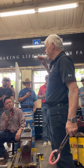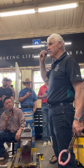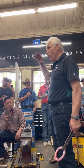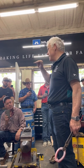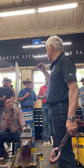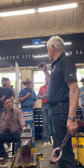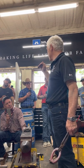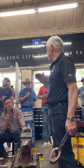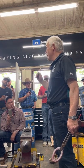If you forge it down before you've got it welded, you will have cracks in it when you finish. You've got to weld the scarves in while you have thickness. If you forge it and it's flat, it's still got scarves in it, you're not going to get rid of them. The first thing I weld, I'll ask you as a question: can you forge cold? Yes. Can you weld cold? No. So I've got to weld hot, and then I can draw it down when it gets colder. I'll flatten it out when it gets colder. But I can't weld it when it gets colder.